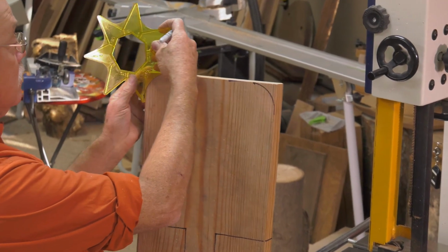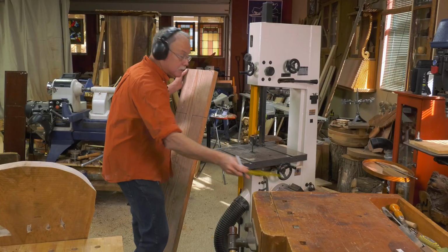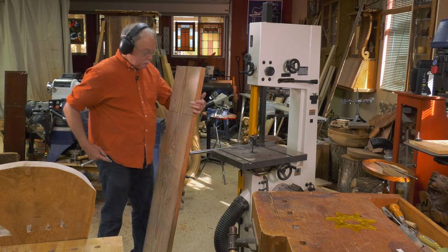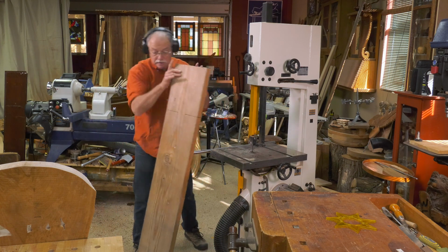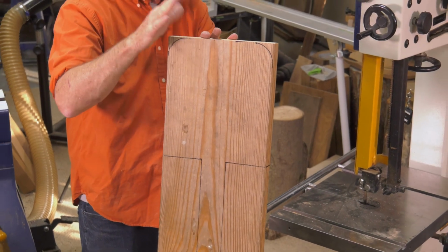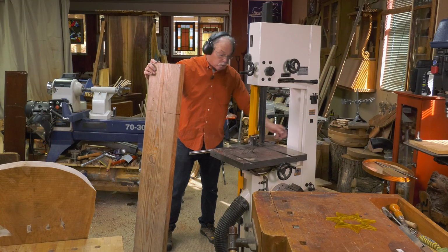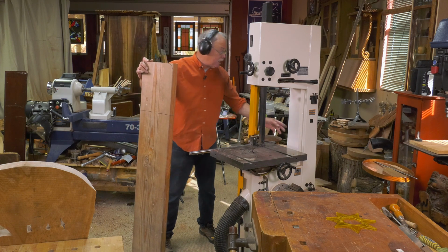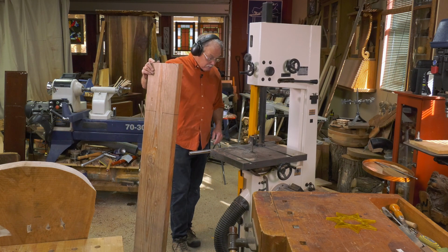And the reason we haven't used the bandsaw up until now is because the throat capacity is 14 inches. Okay, so now I can make all these cuts on the key, including the long tongue. This workpiece should be 5 feet long. Okay, dust collector on, I'll make all my cuts with a 1/2 inch wide blade, silicon steel, 4 teeth per inch. Bring it up to speed.